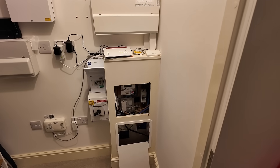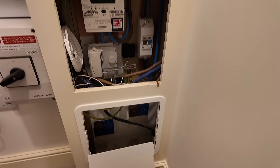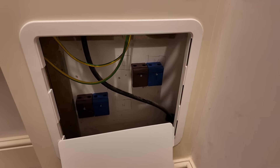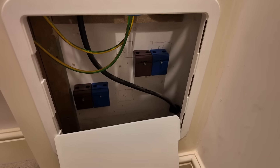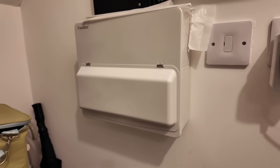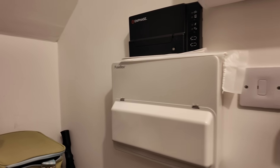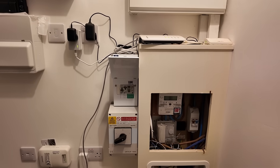End of day one. We've got a new hole in the box that was covering the meter and other equipment - this was required because they needed access to add a few Henley blocks, which are in place and ready to take inputs that can then be split for other sources. This original box for the Give Energy system is going to get removed as it's all moving over to the new consumer unit, and the Enphase control box will go to the left of that, looking nice and neat.